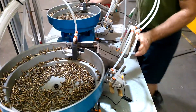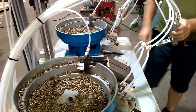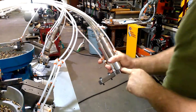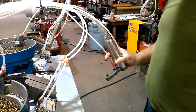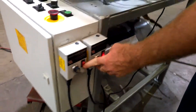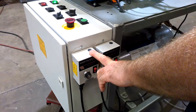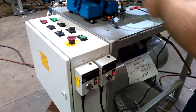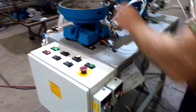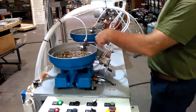I'm going to turn the air back on. Two critical things: hold on to this because it's going to have a tremendous amount of air coming out, and I am going to turn off the potentiometer — that's this little device here. The reason I've turned that off is because I want this to run, but without it being connected the screws aren't going to go anywhere. So by turning this off, it won't be feeding us new screws — it'll just be going back and forth.